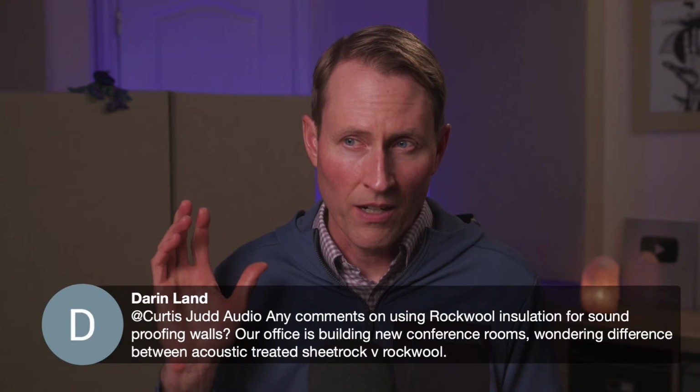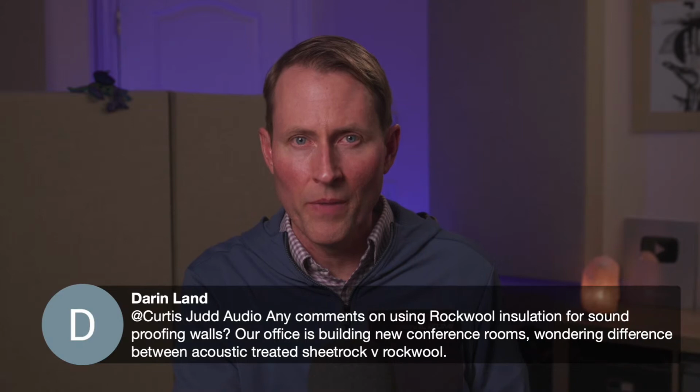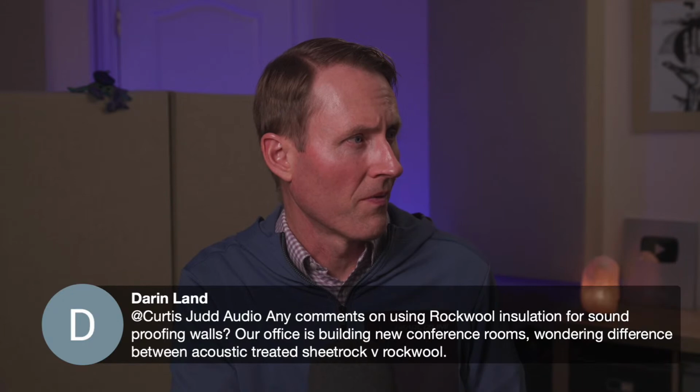So that's what the rock wool will do in the walls. It will help manage some of that lower frequency stuff. And if you've got traffic outside, it will help manage a lot of that, because there's plenty of low frequency stuff going on there as well. So hopefully that helps, Darren.